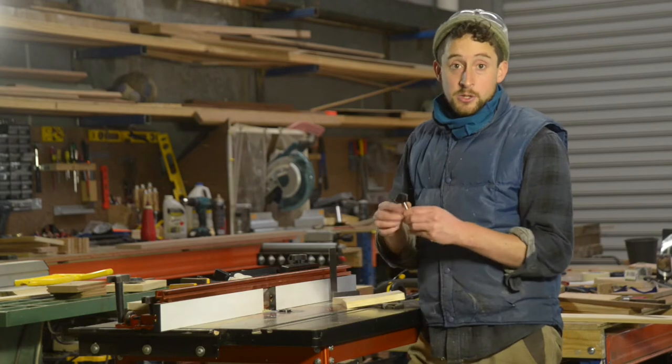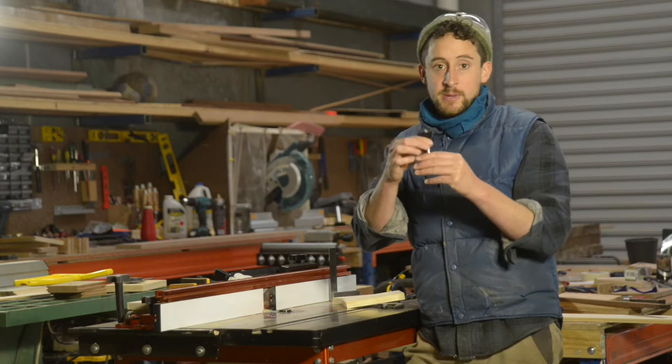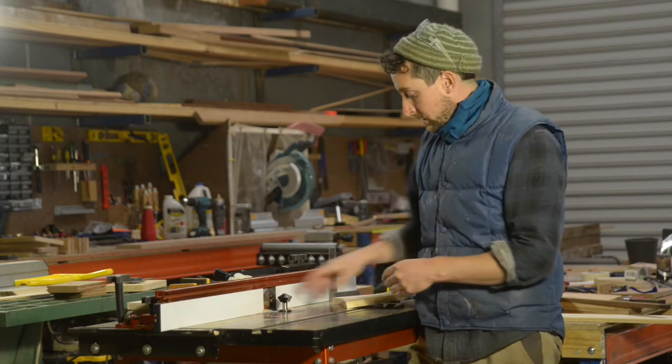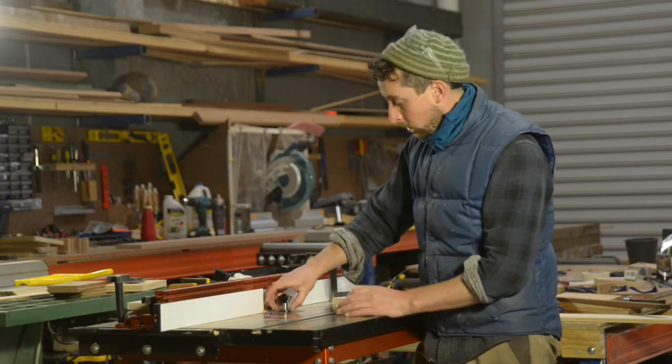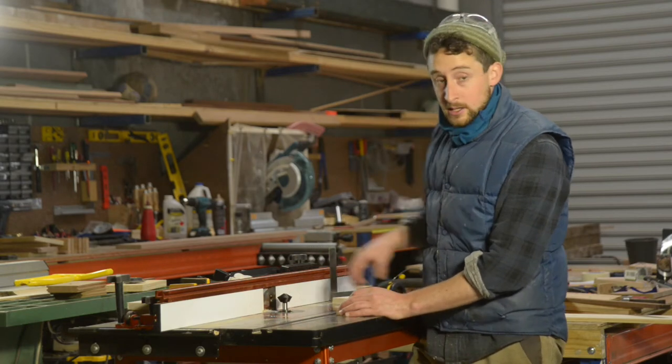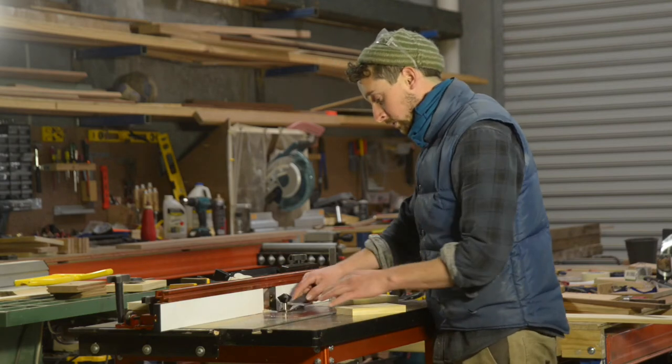The first thing I'm going to do is make a 6-sided box. The length of our top blade is about 17mm so I've machined some stock down to 17mm to get a really nice smooth edge. We'll lock this into the machine and I'll show you how to get the height and the fence adjustment set just right — it's relatively simple for this operation.